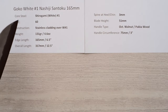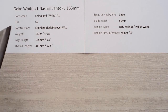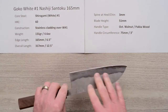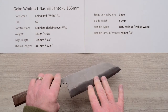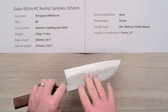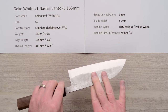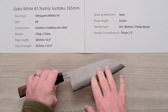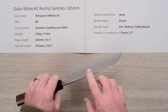These are a nice line for people maybe getting into handcrafted Japanese knives. The construction is a softer stainless steel cladding over the top of that core steel, so the core steel is reactive at the edge but the cladding is stainless for easier maintenance. We've got a three-layer sandwich, and this core steel has what's known as a Nashiji, or pear skin, kind of mottled finish to it.